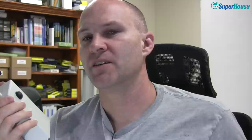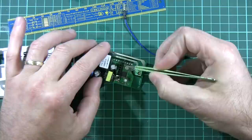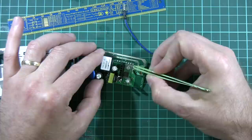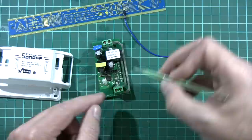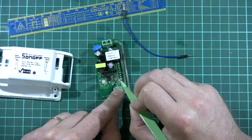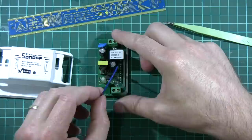There is another way you can hook this up. Inside the Sonoff is a little header that we've been using to do firmware uploads — it uses the first four connections. But what's the fifth one? This is GPIO14 on the ESP8266. That gives us an extra IO line we can use to sense an external switch. Even better, because the Sonoff is designed to have a sensor attached to it, there is a 10k pull-up attached to this pin. That means it's dead easy to attach a switch — all you have to do is attach the switch between this pin, which is pulled high by default, and ground. So you can have firmware which simply detects when GPIO14 is connected to ground — then it knows the switch is closed. When it's not connected, it knows the switch is open. Super handy.